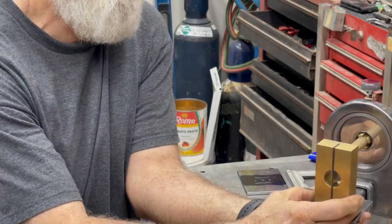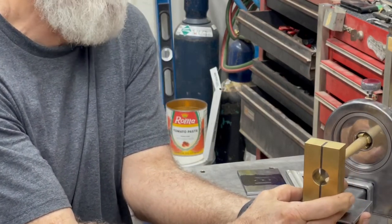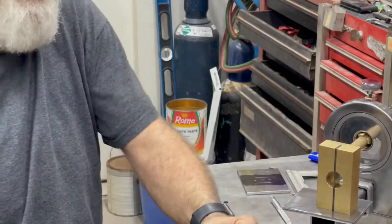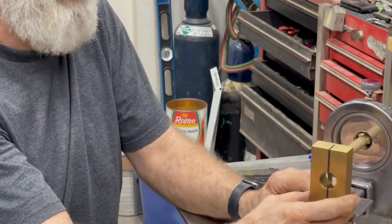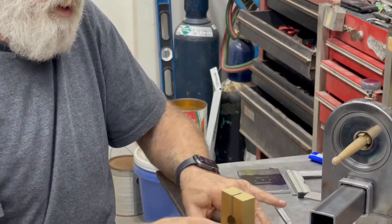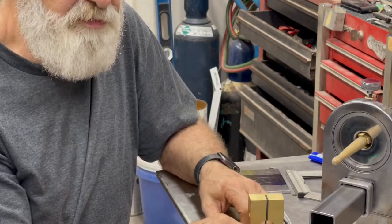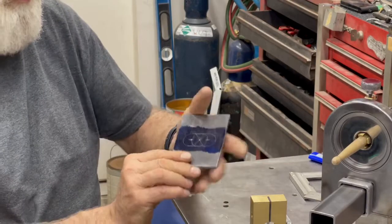this way. So in doing that, you could put a series of, say, four or five cuts this way. Then turn this guy 90 degrees and do the same cuts back the other way, and you would have a square pattern. Anyway, the trick for me, aside from the rest of it, is figuring out how to adjust this guy back and forth in such a way that it's easy to adjust, easy to take it out and change the blade, and it stays fairly precise while it moves. And so I'm starting with this.